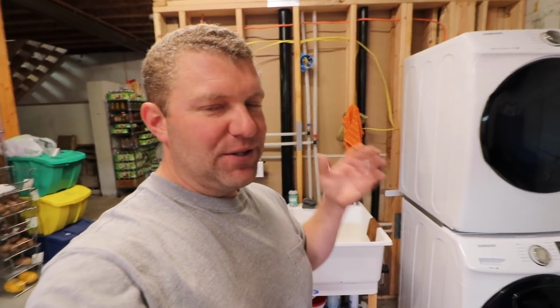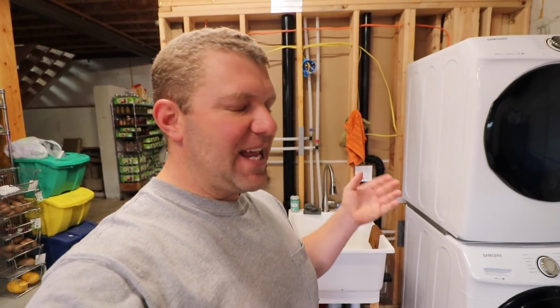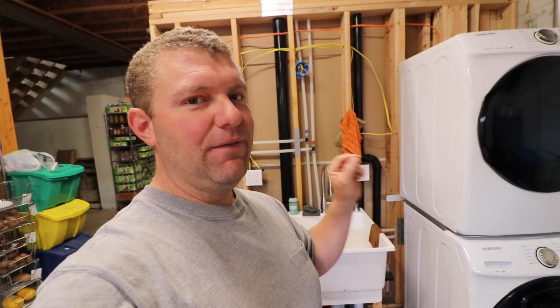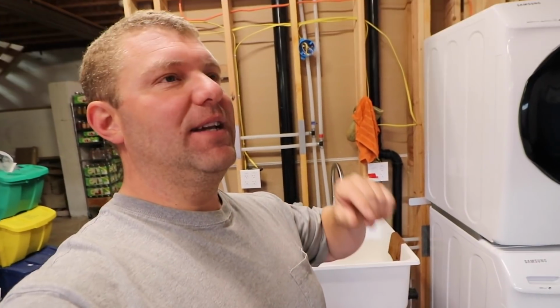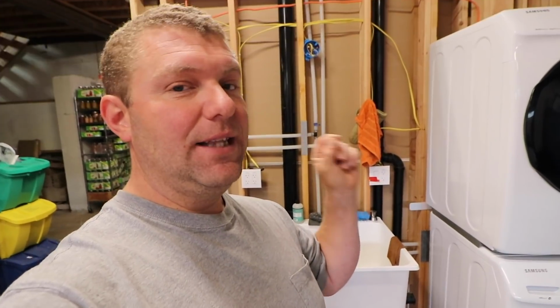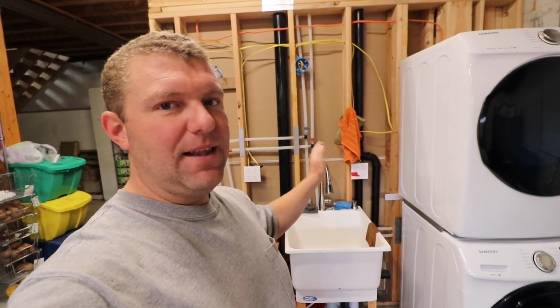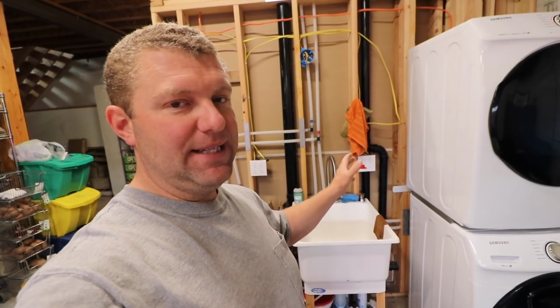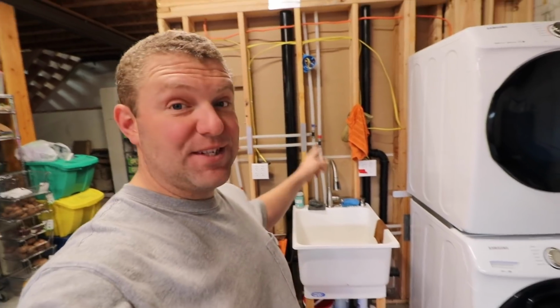And I know there's somebody out there who's watching this video who's thinking to themselves, why don't you put siding on your house? I'm gonna say it one more time, a little slower for those folks who maybe aren't so quick to catch on. We can't put siding on the house because we haven't foamed the walls. We can't foam the walls because the electrical is not done. And that's kind of how SIPs work. We'd rather work right now on an instant life upgrade. Getting this complete will make our lives a little bit easier today. Siding, electrical, and foaming the walls is in the works. This is what we're tackling right now.